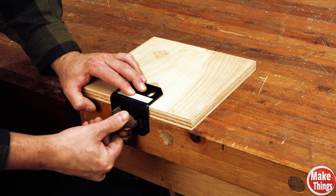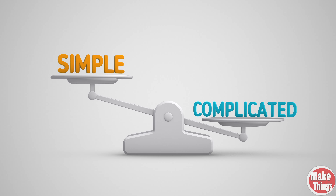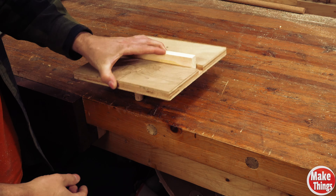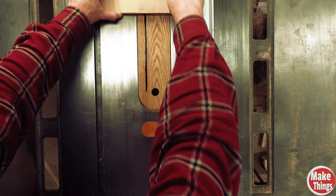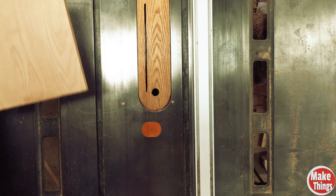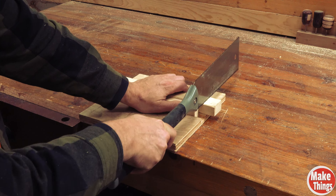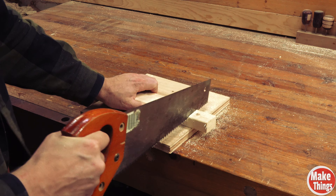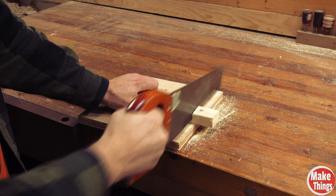Originally I had planned on using metal brackets on the edge and a knob to lock it against the table side. While this would work, it would have complicated the very simple nature of the bench hook. Next I took the simplicity route and split the table in two parts with a fence down the middle. To hollow out the center I used a table saw set to three-eighths depth for three-quarter inch plywood, then added a three-quarter inch dowel in the center. It seemed to work, except it pivoted on the dowel when I made cuts.